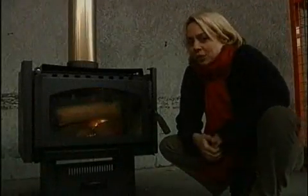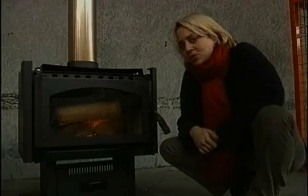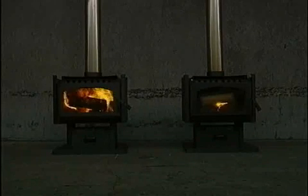Look how sluggish our wet wood is. That's because it's trying to evaporate all that excess water that's laden with unburnt chemicals and resin. The problem is that all these go up the chimney, and because we haven't been able to get the flue temperatures to the right operating levels, it's likely that the water and chemicals will condense on the inside of your flue, and that means output from the flue will be smoky and dirty.